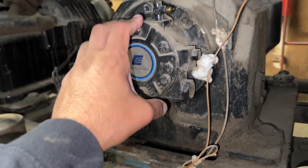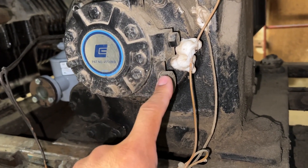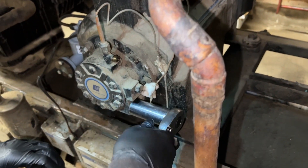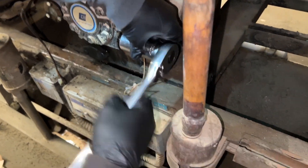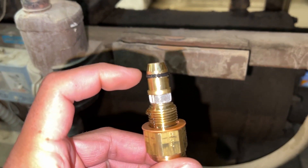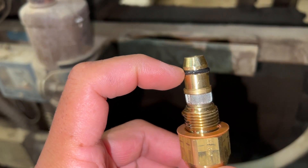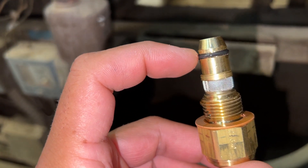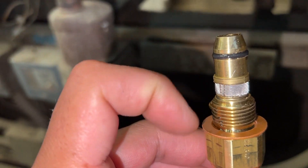We're gonna start on this compressor first. To speed up the process, we've already pumped down this compressor. We're gonna go ahead and loosen this up and replace it with the new Centronic. First, he's gonna loosen up and take out that plug - that's a one-inch socket he's using. Then we're gonna replace it with this Centronic sensor. Remember, this O-ring right here comes in the package but it's separate - it doesn't come already attached. Make sure it's on there properly with no rips or tears. And then this is your copper washer - make sure that's in as well.